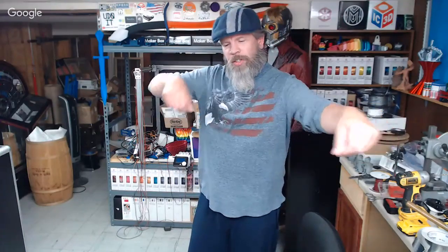I've already seen a problem. The metal belt I ordered was supposed to be 400 millimeters wide. I unpackaged it yesterday and I was ready to put it up, and I took the tape measure to it because it looked wide on the printer. Yeah, 413 to 415. I'm like, damn it. So I straight edged it out and scored it, and then I took my scissors and cut it as straight as I could. Either I deviated a little bit, because now I'm seeing not quite a millimeter of metal showing on the side of my belt, or I'm hoping when I get around further it comes back over and I go, okay, I just didn't cut perfectly straight.